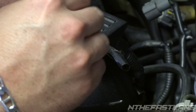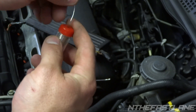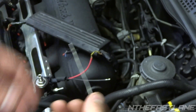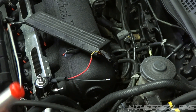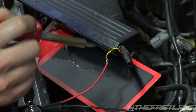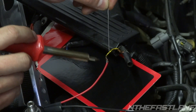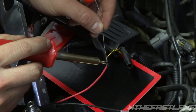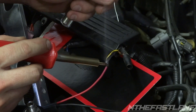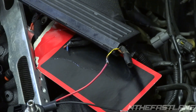You don't want to mess up the joint you just made. What's nice about the solder that comes with this iron is it's really thin, so you can pull it out and feed it in without it piling up. If you have a nice intake manifold and don't want to ruin the paint, put something underneath in case solder drips. Our soldering iron appears to be hot enough — and there we go, a nice joint. You can see how the flux heated up and allowed the solder to melt nicely between those wires — that's how you get a good connection.